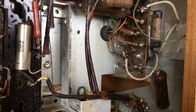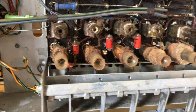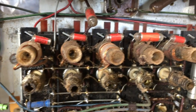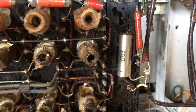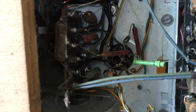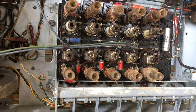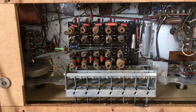There are quite a few capacitors to change on here — all those caps are probably going to have to go. The usual recapping, though not the polystyrene ones — those red ones very seldom have a problem. These coils usually just need cleaning. A few more caps in here as well. So this thing needs a recapping, an alignment — or adjustment of alignment — and a lot of cleaning, as usual. This hobby is 90% cleaning. If you don't like cleaning, choose another hobby.